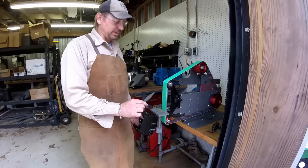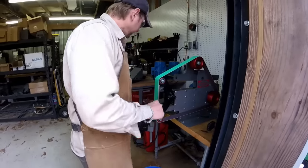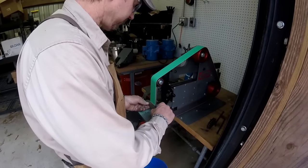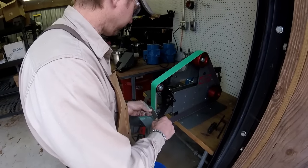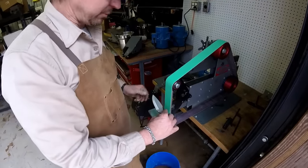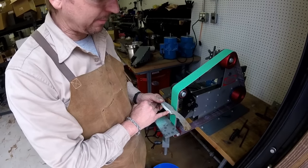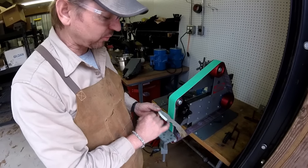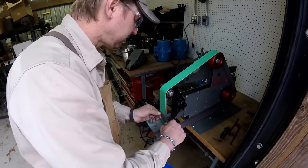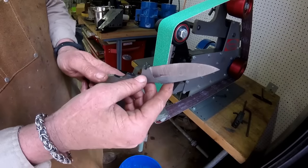What I'm going to do now is just flat grind this real fast. One of the things I'm going to do is make sure my plunge — which I really want to be back here — I'm going to make sure it's a little farther forward than I would really want, about three-sixteenths of an inch further forward. There's my two-inch grind line. Hopefully I can get that out. Now let's go to the plunge attachment.